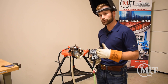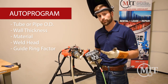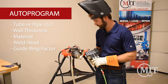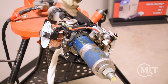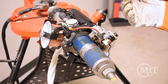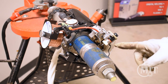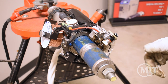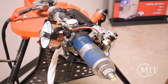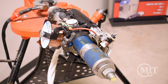Today we're going to do some welding on two-inch schedule 40 piping. When using the auto-program feature, all you need to know is the tube or pipe OD, the wall thickness, what material you're working on, the weld head, and the guide ring factor. So we've got two-inch schedule 40 carbon steel — let's get started. Once the weld program is created, you typically start in the two or three o'clock position. You can also adjust the wire angle and how far the wire is from the tungsten. Get everything situated, center the D-Head on the joint, and you're ready to weld.